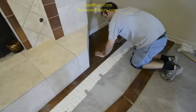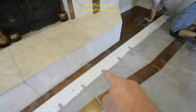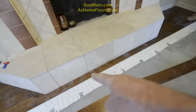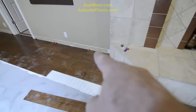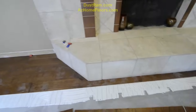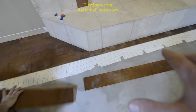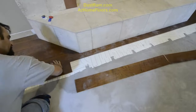See how that all just joined right back on together? You're probably wondering why there are little spots in the floor with no glue. The reason is, as the wood goes underneath this hearth, there's going to be no way for us to hook a clamp onto it. From over there to here we'll be able to put clamps on to keep it together, but since we can't do it here, as we line this up we're going to put a spot of hot glue on each of these, so as this last row goes in it'll be locked into place and won't slide anymore, and we'll be able to join on the rest of the rows and push against them.